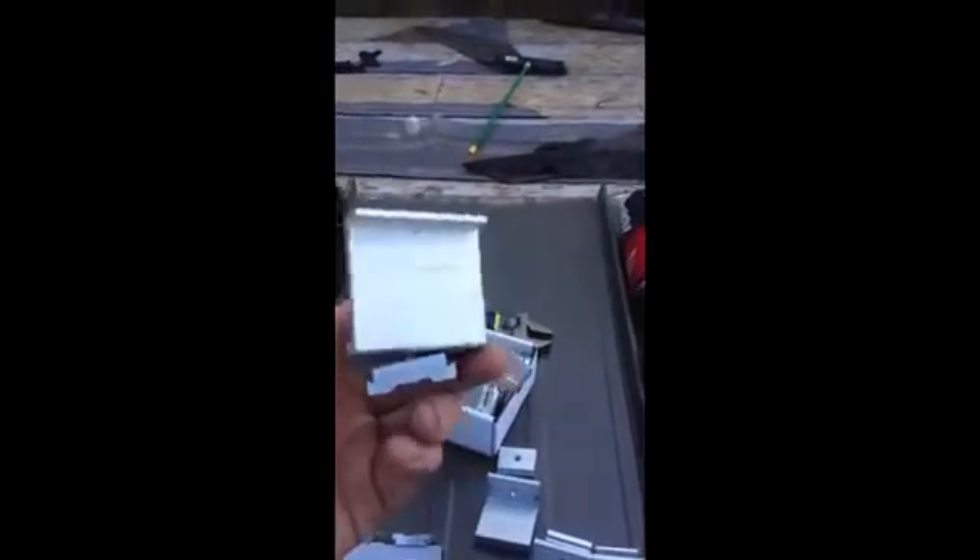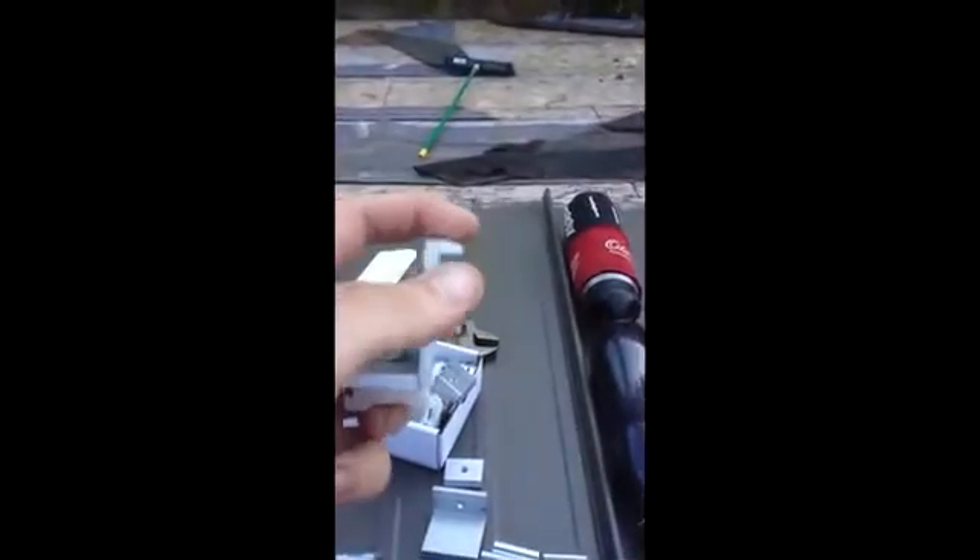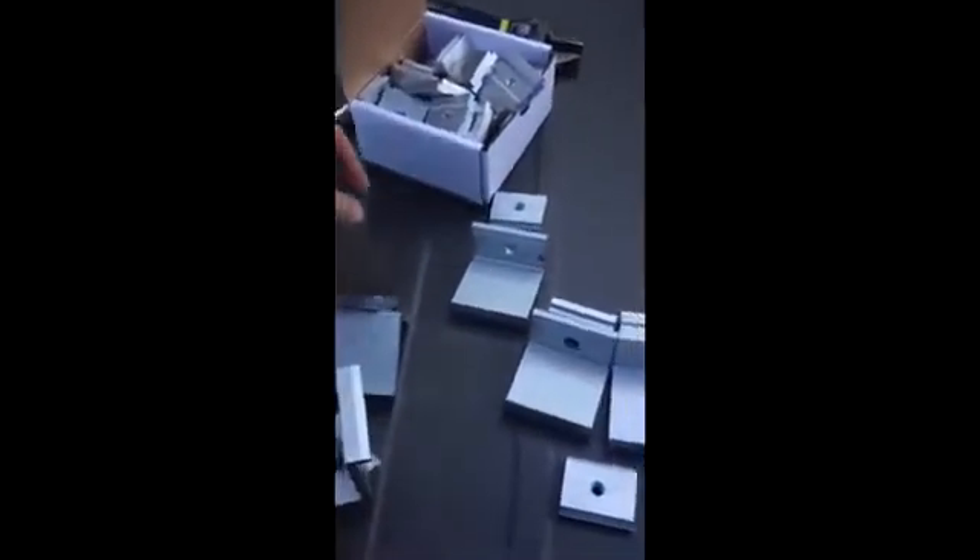Here are the Pro Solar rack mounting ends. These pieces slip between the rail, twist, and then tighten down, and they clamp the panel right here and hold it down onto the rail. There are two of them, and then in between the rails, the same piece goes underneath — but we do a sandwich piece, and that has a slightly longer bolt that goes with it. So we're going to start putting the panels up now.